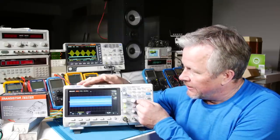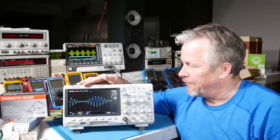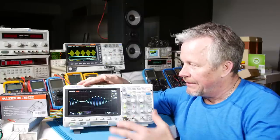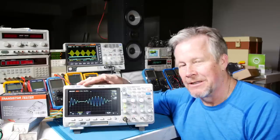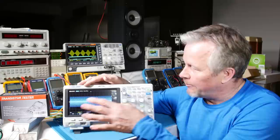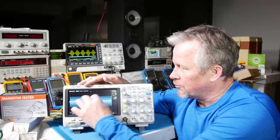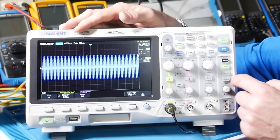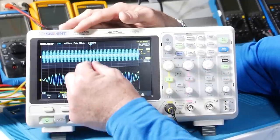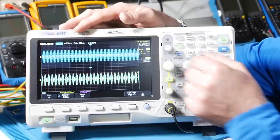With deep memory I can just capture this waveform, stop the trigger — all that data is in memory. Then I can zoom in, and it looks just like it did at bird's eye view. It's like having a camera with lots of detail — that's deep memory. That's why this digital scope acts like an analog scope. I can trigger on a spike, and when it captures it I can scroll over, zoom in, and see that little dark area here: this waveform comes from that little spot right there.